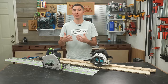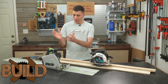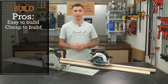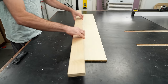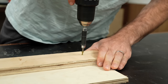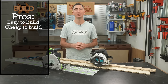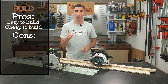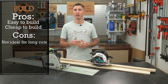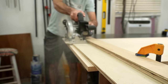With a track saw, there is no math needed — you simply lay the edge on your cut line and get going. So should you build, buy, or pass? Building a track for your circular saw is possible, and very budget options can be as simple as a known straight piece of wood screwed on top of another. Keep the base plate of the saw pressed firmly against the fence and you have a track saw of sorts. On longer cuts, it can be tricky to keep the base plate in contact with the fence, especially if you find yourself reaching.